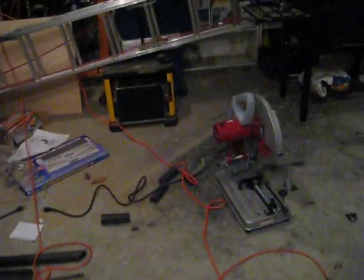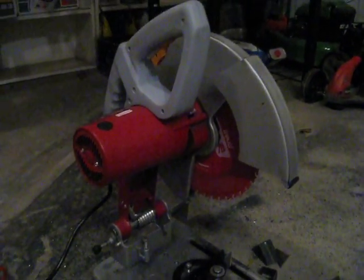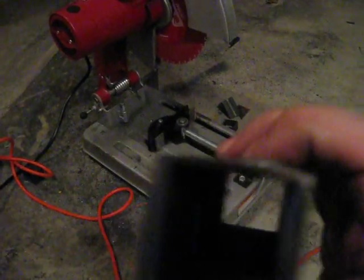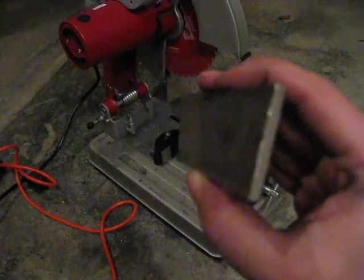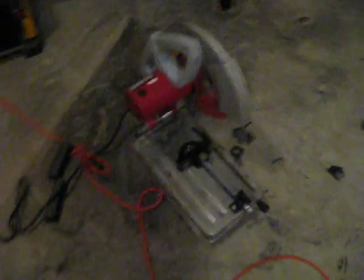I got some stuff that made my life easier. This is a regular carbide tipped saw blade — for wood only — and it tears through that metal. You can see the difference: this one was made with an abrasive wheel and you can see these little crap pieces that come off of it. Here's the one with the carbide tipped wheel — nice and smooth, no little pieces. I think it's dulling pretty quickly though.